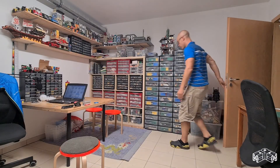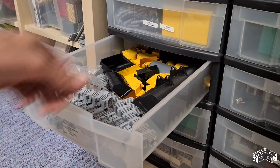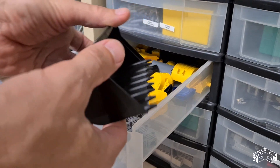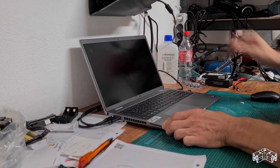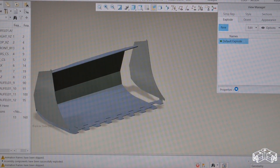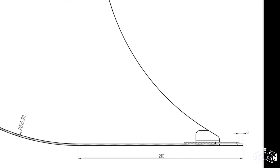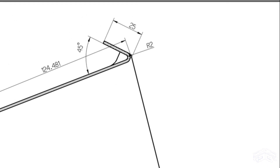The basic layout is somehow an offspring of typical Lego shovels. I went for a width of 720mm, which complies with the Infento 40mm pattern. I had to keep an eye on the weight, which was easy as I used a 3D CAD system for designing. By using 2mm sheet steel, I came out at a reasonable weight of only 10kg. At the scrape edge I stacked two sheets to improve the stiffness, and at the top side the stiffness was achieved by a V-shaped bending profile.